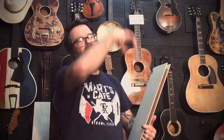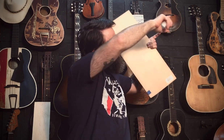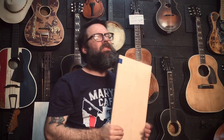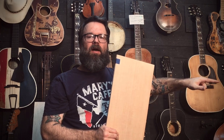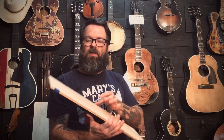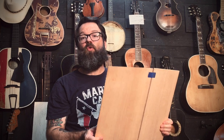On an X-Y graph, spruce is one of the lightest woods way up here and one of the most rigid, so it's an outlier — really light and really strong. There are a lot of very light woods that are very weak, and a lot of really strong woods that are very heavy. As far as a top goes, it needs to be rigid.